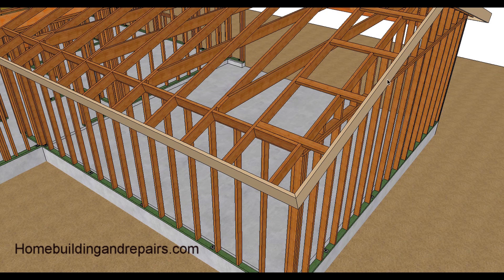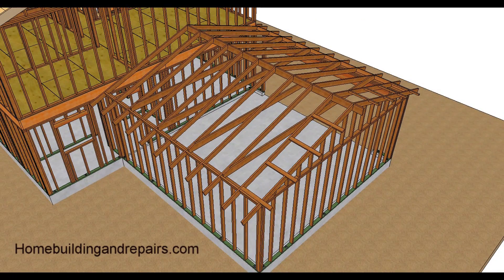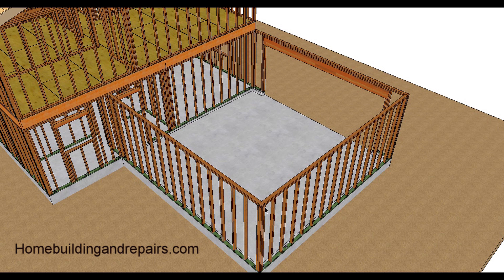At the other corner we have our lookouts — two-by-fours supporting the fascia and the roof overhang — plus the blocks and rafter ties. Zooming out, there's a good picture of that. Let's get rid of the fascia board and the roof to see what's underneath.